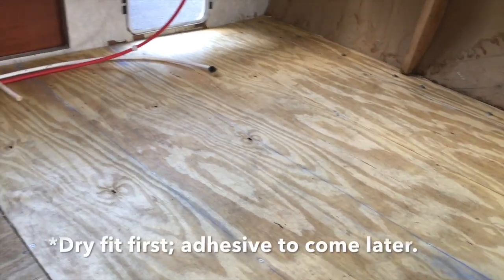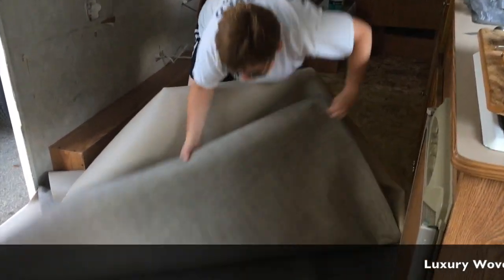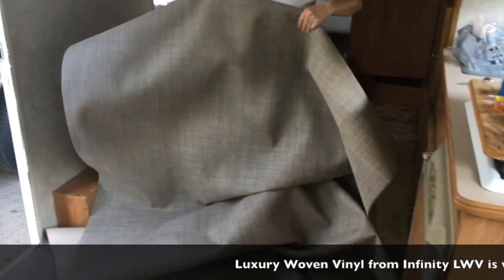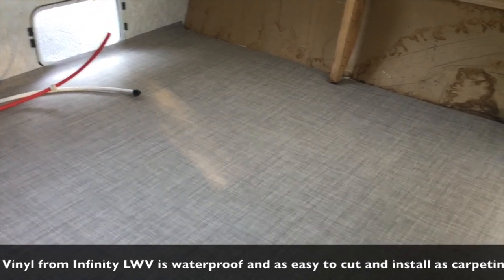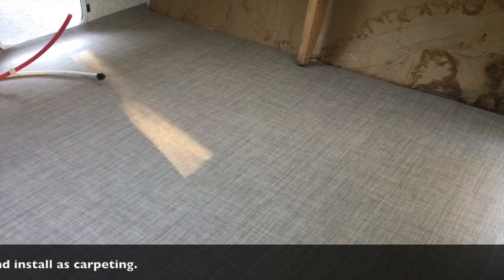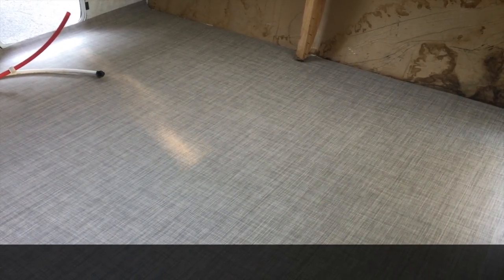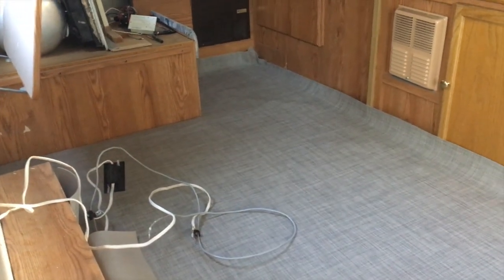Welcome to day 10. Today we're putting down the vinyl flooring. We've cut a little bit of it but we're going to cut and measure as we go. The floor is swept and ready. Day 10 is cut short because I did not bring the right adhesive — the kind I bought does not work with vinyl, and this flooring has a vinyl backing to it. It's Sunday night, stores are closed, so we'll get to this tomorrow. However, we did roll it out and got it loosely fit into place. Looks great.